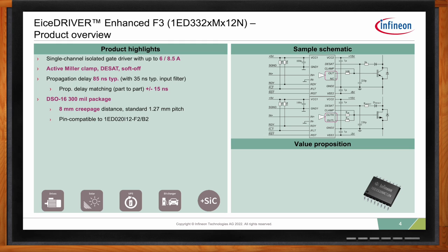And here on the right side, you can actually see the two different pinouts. So we have a part which keeps the old pinout, the one on the top where it says OUT and NC. So the original part came with a not connected pin and a single output. But for modern applications, we want to give the customer the opportunity to control both sink and source. So this is why, because the package allowed, we now have sink and source capabilities.